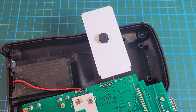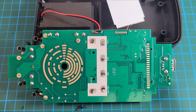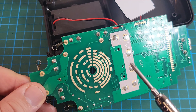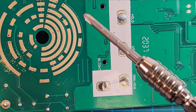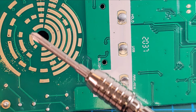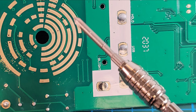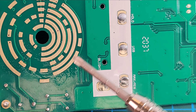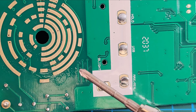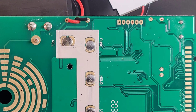Flipping the PCB over — no other protection on this side, but some pretty decent-looking tracks. As mentioned earlier, this was a mess when it arrived with grease all over the rotary switch contacts. Cleaned it off with isopropyl alcohol and applied just a little bit of dielectric — a little goes a long way on the rotary tracks — and it performed 110% better afterward.